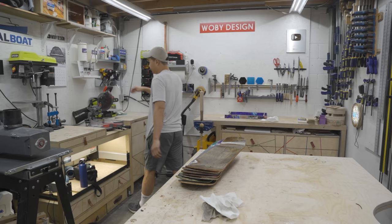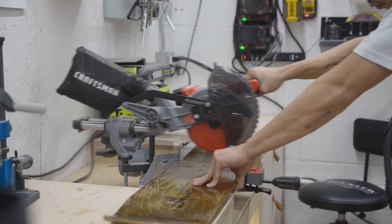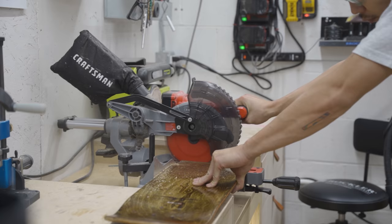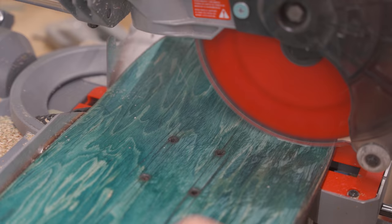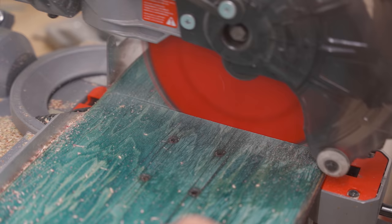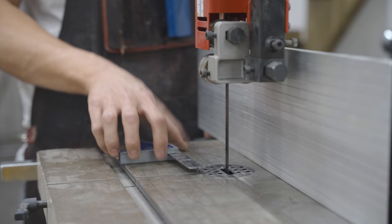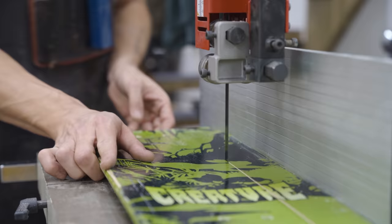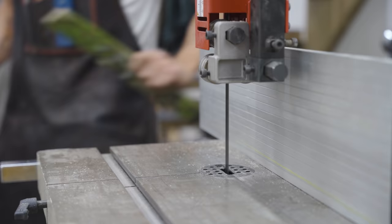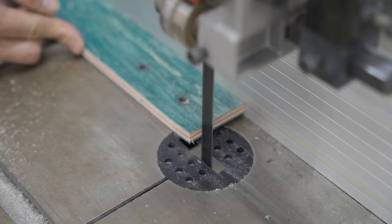Back to the build. I have all these skateboards cleaned up and ready to be milled up into more usable lumber. For this project, I just need the straightest part of the skateboard so I could cut the nose and the tail off and use those pieces for future projects. The best way I found to cut the nose and the tail off is to cut about an inch away from the outside truck holes — this gives you the flattest part of the skateboard, pretty much taking away one of the concaves. There's still a ton of concave on these skateboards and it's really not safe to rip them on the table saw, so I like to use my bandsaw. I'm setting the fence two inches away from the blade and that usually takes away the majority of the concave left over. Since most skateboards are about eight inches wide, setting the fence two inches away from the blade gives you four strips. These skateboards have straight edges on the sides so you could reference that off the fence and get a nice straight cut.